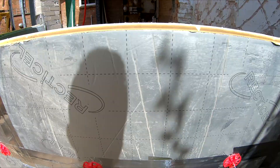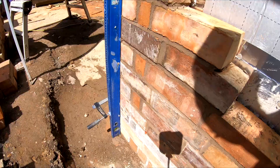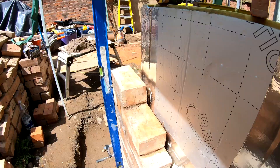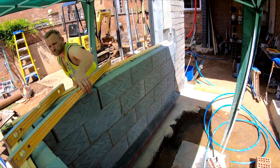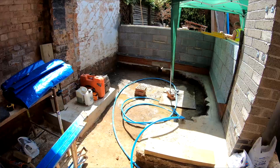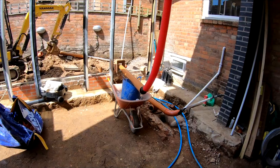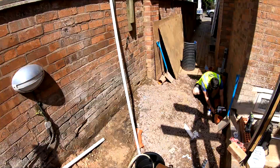We foil tape all the insulation up and put the red clips in. We've got weep holes here which allow any water trickling down to come through - there's a 10mm gap and a 15mm gap. We tape all the edges up so no moisture gets in at the ends. We've also used seven newton thermal light blocks because that was the engineer's specification. We need to make sure it's all mortared. Then we're getting all the drainage in, and prior to that, getting all the insulation and concrete in ready for Friday - plus the external drainage and the brickwork in these thinner columns.